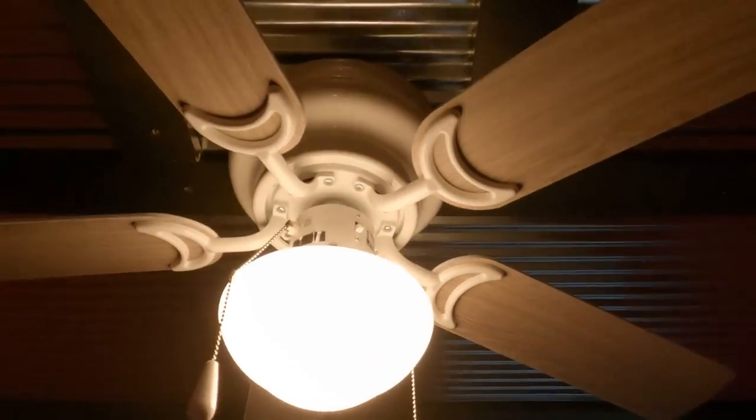Let me get this camera right. Why did I put the blades on? You can see that screw is way off, that is where the actual joist is right there. So that has to come over a couple inches. No problem. That's a very fast fix. The board will still cover the holes that were made with that one. So that's what we're going to do.